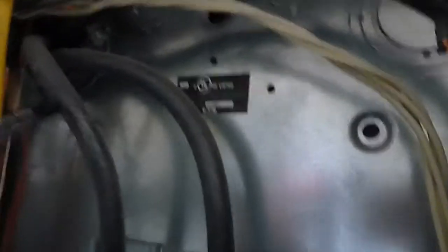Bundling — see how all these wires come in individually? That's nice. But these others come through a larger knockout — they took that one out and brought all these in together. No double lugging. The bonding location is not labeled. We've got a single ground. By current standards, when this was installed, a double ground should have been done.